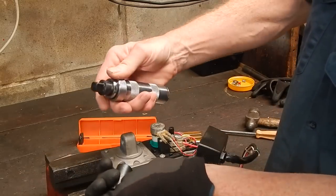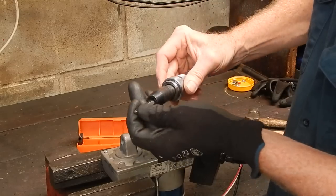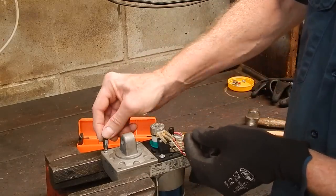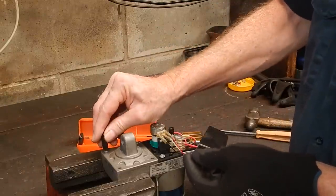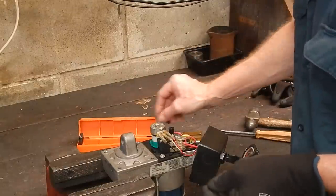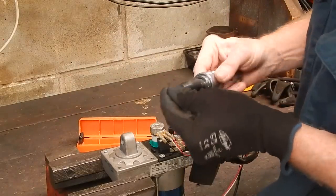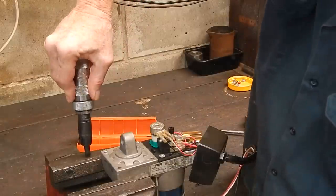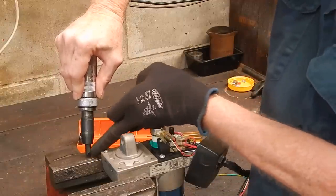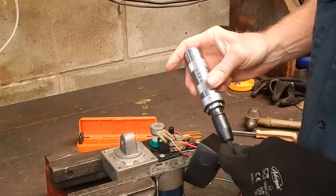They take a bunch of tips and also take a half-inch socket, so you can use them on nuts and bolts. In this case we're going to use it on the screw. You've got the choice of a bunch of tips — there's a Phillips head one you could use, but as it's got a slot in it I'll use the slotted head because it will give more purchase and you've got less chance of tearing the head up. The way these things work is as you push down and hammer down, they'll either unscrew slightly or screw up slightly depending on how you set them — we're going to set it so it unscrews, which is nearly always what you use them for to break free stuff that's frozen.